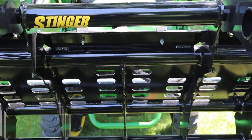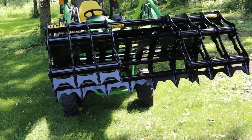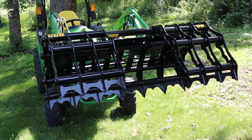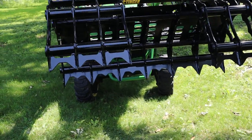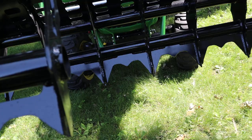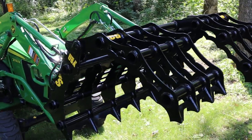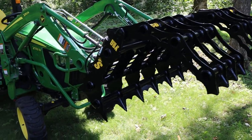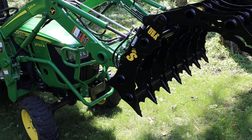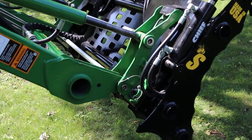We also have a support tube on top. One other thing I want to point out is we did the clam grapple in an independent grapple design. The reason for that is so that if you're pushing down trees or anything, you can actually push right down on the tines in the center without using your grapple. There's a nice spike on our cutting edge — through testing we found that helps get a nice bite to push down a tree, and it also helps protect the grapples. With the grapples being independent, over that entire width you're able to secure loads with uneven objects. We use very nice greasable hydraulic cylinders on this unit.